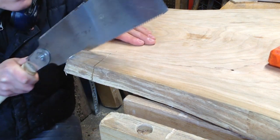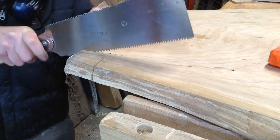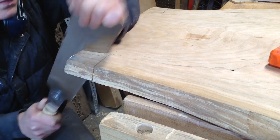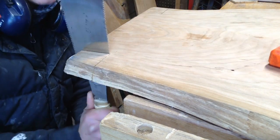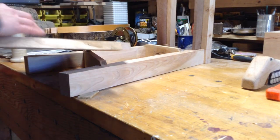I'm going to saw off some rough chunks and then fit it into place from there. It was a lot of putting it in place, taking it off, trimming a little bit, and doing that repeatedly to get it to fit really nicely — because it's one of those processes that if you take too much off, there's no going back.